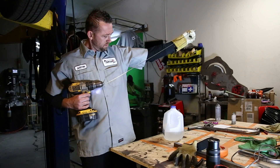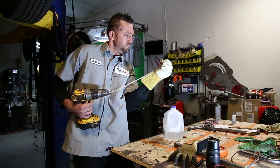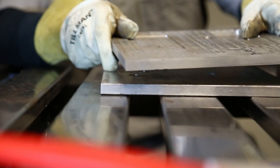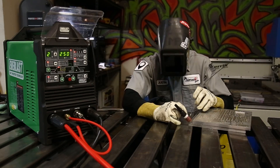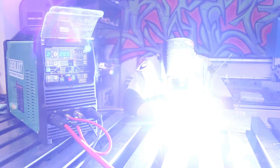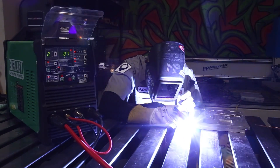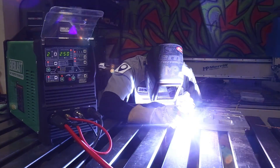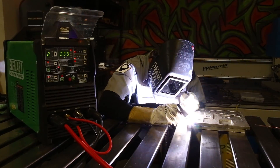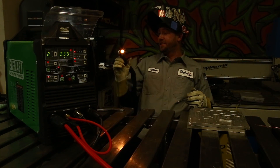I don't have the correct diameter filler rod to actually run this pass smoothly, so I'm going to take three 1/16th filler rods and twist them up into a nice little bundle — that should compensate for it a little bit. These are my half-inch aluminum plates, 6061 aluminum, no prep whatsoever. We're just going to fire it in and get welding. Now, here's the funny thing about video: 250 amps is insanely bright, so we actually had to stop and reshoot under different settings to darken it out so you can actually see. As soon as I get to 250 amps, I'm just going to start plowing right through this — full throttle the entire way through. It took about a minute and a half to weld what I did, but this is all sped up, and it would have happily kept on going. It offered no sign of giving out, except I had to stop because the torch was getting a little hot and it's ridiculously bright.